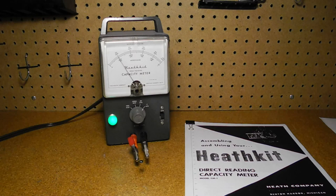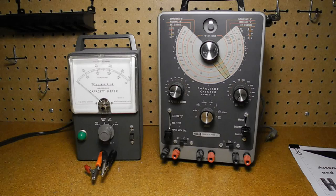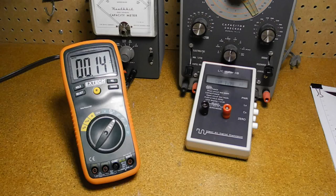The CM1 had been on my list of Heathkits to acquire for some time. It was the only capacitance meter of this type that Heathkit offered and it's relatively rare. Its advantages included ease of use, low cost, small size, and the ability to measure quite small values of capacitance. Its main drawbacks were that it could only measure pure capacitance — any resistance will throw off the reading, and even a resistor will give a reading. It can't measure larger capacitors over 0.1 microfarad, and it can't measure resistance, inductance, leakage, power factor, Q, or other component values. It's not particularly accurate, with only a few ranges with a 10 to 1 ratio between ranges, and it was line powered and not portable. It was mostly made obsolete by more accurate and flexible cap testers and impedance bridges, and today most digital multimeters have a basic capacitance function, as do inexpensive digital LC meters.